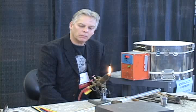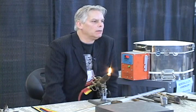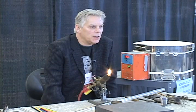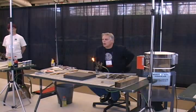I'm going to be working with a kind of glass here. This is a lead-based glass, but it could be a soda lime glass or a barium-based glass. It's used for neon. And one reason that I like to use it is because it's inexpensive. You can still find it for about $1.50 a pound, which beats borosilicate. And also because of the materials that are compatible with it, which are the same glasses you would use for the hot shop, like Kugler and Zimmerman, Reichenbach, Gaffer, Wiesenthal, Hoot. There's all kinds of different companies that make 100 to 200 colors. And all those are compatible with the lead glass.